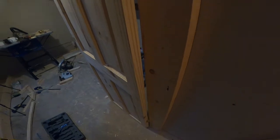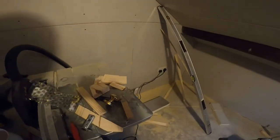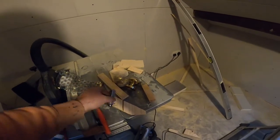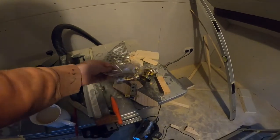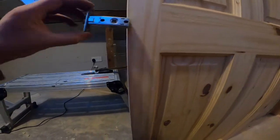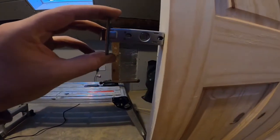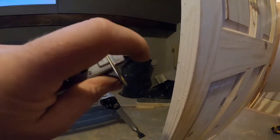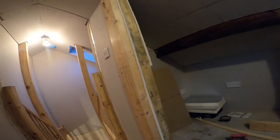I've got the door on the hinges — it's in top and bottom and it freely opens and closes. My next stage is the lock. I've got the usual suspects from Screwfix — just the Victorian-style brass round knobs and the lock with the center pin and everything. To begin with I'm going to mark it on and center the lock in the middle of the door edge. I'll drill to the depth of the lock, push it in, draw the shape, get it flushed, mark and drill through for the spindle, fit the knobs, and then do the frame side.